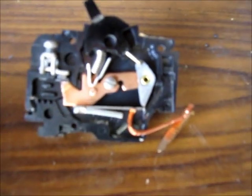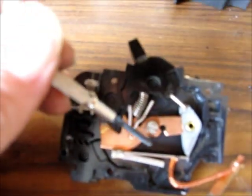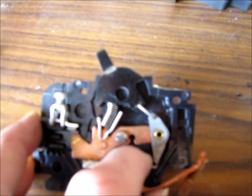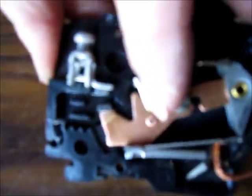The key feature of a circuit breaker is that if there's too much load, it's supposed to automatically open up the switch. If too much power is being drawn, this little plate starts to bend away from this tab right here. I'm not going to load it up with 30 amps for obvious reasons, but as this starts to bend down, it automatically opens up this terminal again. And then in order to reset it, you just turn it off and then switch it back on again.